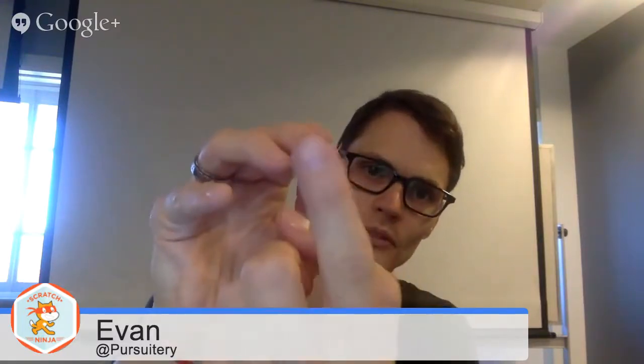But we'll be attaching this homemade antenna with the end of a female-to-female jumper. This little slot is going to click right on our Raspberry Pi, and after we get it up and running with the SD card in it, we're going to be able to broadcast radio. So the next thing on that list is a blank 8 GB SD card.